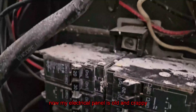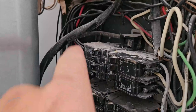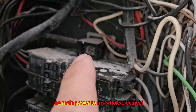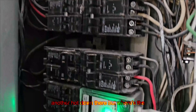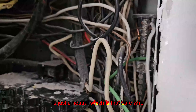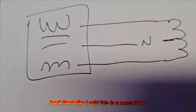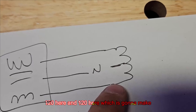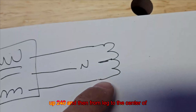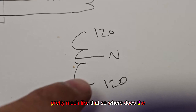Let's look at an actual electrical panel. My panel is old and crappy, but it's perfect for this video because it's a real-life scenario of what you might actually see at a customer's house or your own. That wire coming in the back is the main power to my whole electrical system — this is the main for my house. You've got a hot there and another hot down there. But where's the ground? Well, there is no ground — all we have is a neutral, which is that bare wire right back there. Looking at a utility transformer, the neutral is in the center: 120V on each leg making up 240V, still single phase.